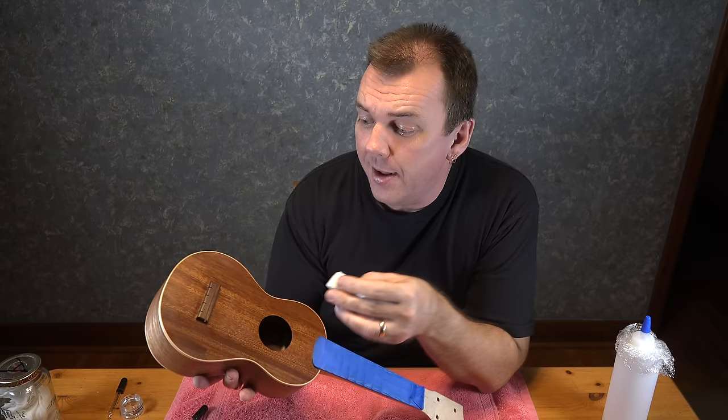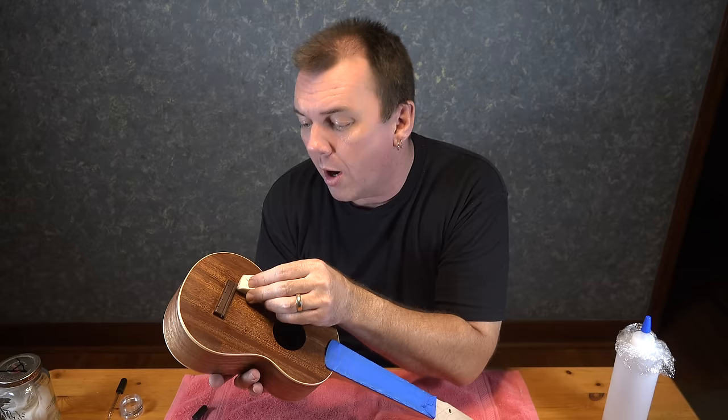And so in the areas here by your bridge, you'll be able to get right in there, get in tight with the shellac, and work it in. As well as for the spiriting, going across the grain, you'll be able to get in tight to the bridge. You may just have to charge it a little more, and or more often, not necessarily with more material.